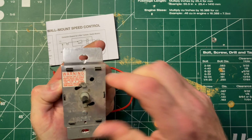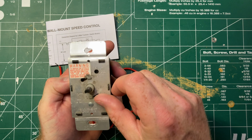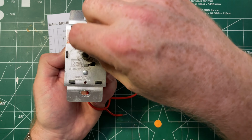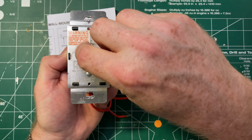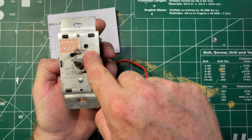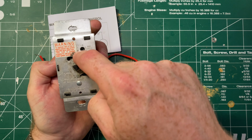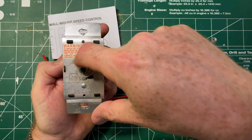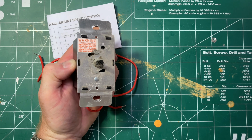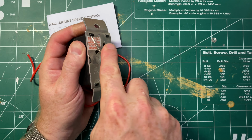We have what looks like plastic tabs holding the front on. There's no screw. This also looks to be tabs. So you have, this is a potentiometer with a switch on it, like every radio. Sounds pretty bad actually. And comes around. That's the speed control. There's a trimmer to set the minimum speed. I haven't touched that, and I don't suspect this was touched on this one either. Oh, so it looks like you snap this off and then this turns to release that. Well, let's find a screwdriver and see if we can pop these off. We don't care if this is destructive.